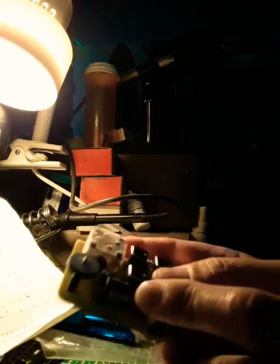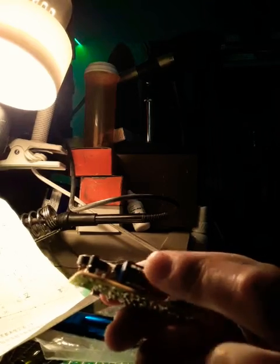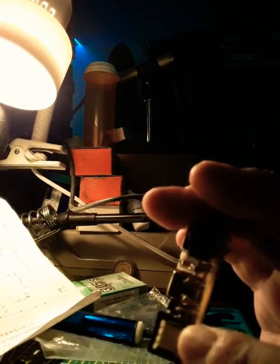Okay, anyways, we're going to install this last IF. It's the white one here. I had a hard time figuring out what goes where, what transformer, but I know the audio transformer goes right after the volume control, as you can see. There's your volume control, and then that's your audio. I always think, always for years, the green is always the go. It's for audio. And your audio output transformer would be yellow. Think of the green going into yellow.